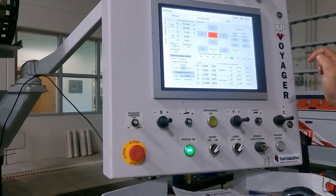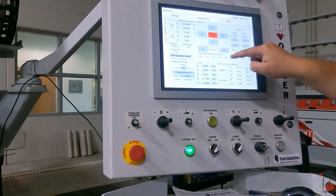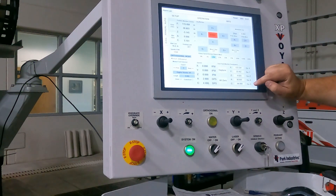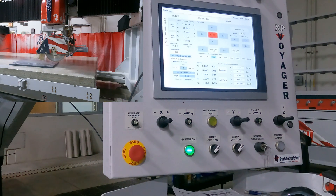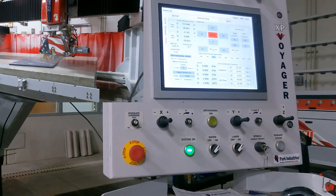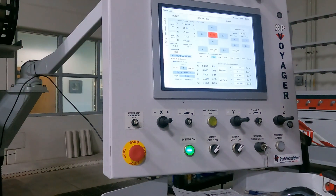When I hit OK and then hit go to C, it's going to execute. I like always being a little bit slow about this to make sure I'm going the right direction. I'm going to hit go to C now that I'm out of my stone and ready. The C axis is slowly rotating until I get to the right direction. Once I get to that right direction, I'm going to have to re-line up my laser for my edge cuts.